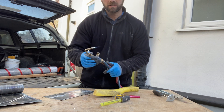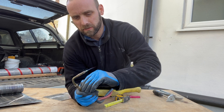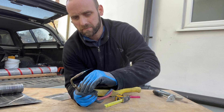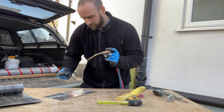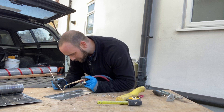Now you can see it's got like a feathery point on it. What we want to do is increase the oxygen until that feather disappears and it goes into a little sharp ball — something like that. Now we're going to put it to the lead to see how hot it is. It's not a bad flame there so we're just going to tap both ends.